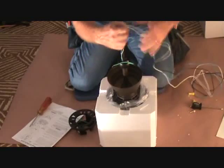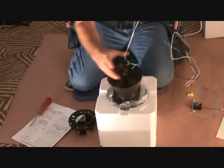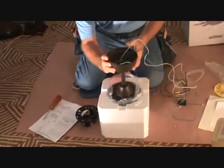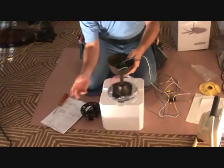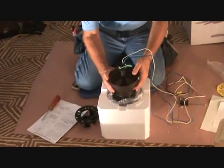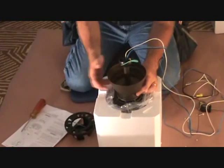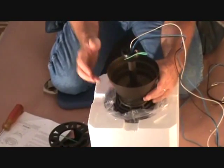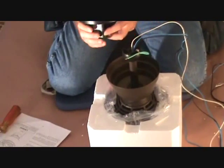This is what your ceiling fan is going to look like so far. You've got your wires coming out of the top, here's your ground wire, everything's tight. Here's your housing piece that fits down in there. Some fans are different - this is just how this one is, so make sure you look at your directions. This is going to give you a complete understanding of how to put everything together. Now we're ready to go over to the ceiling.